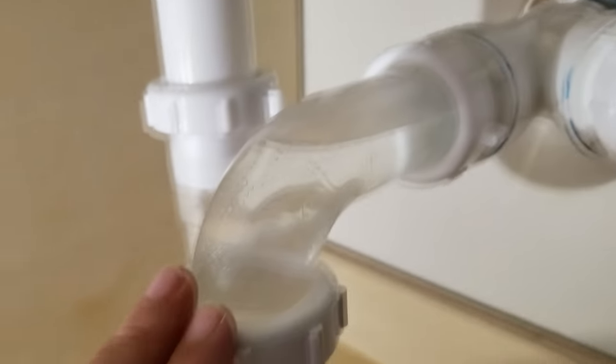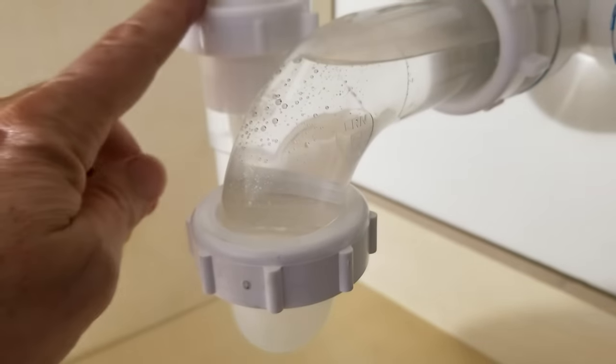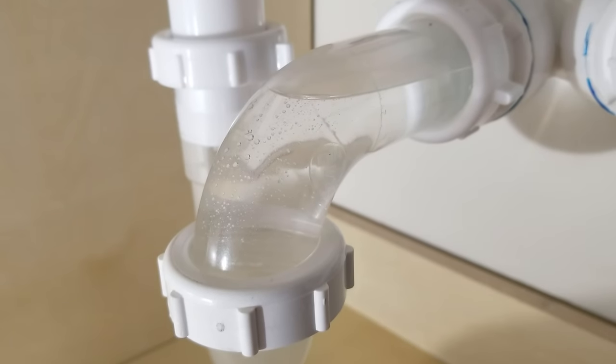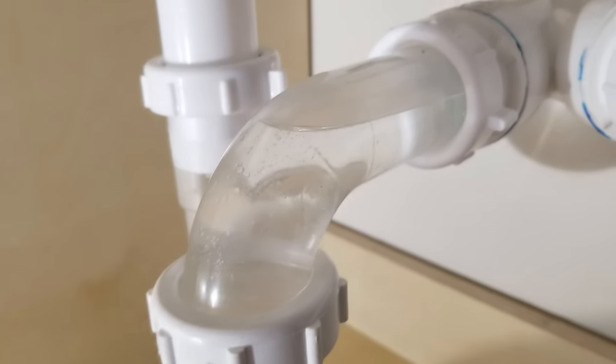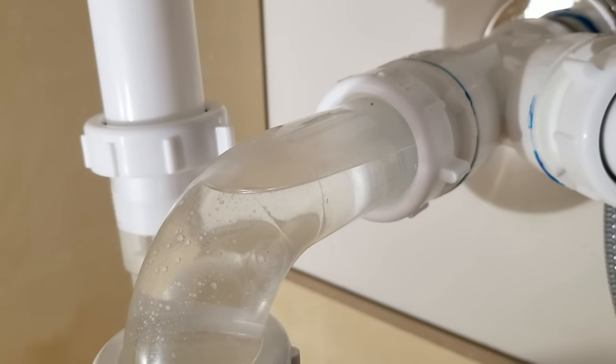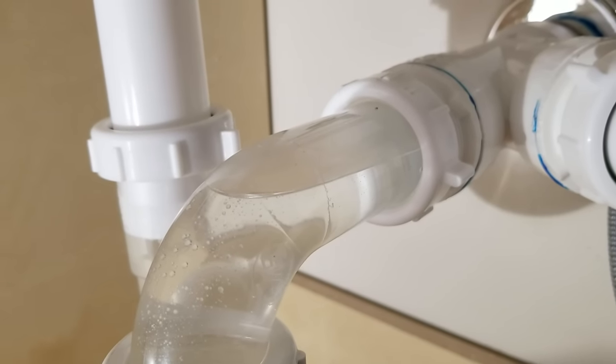And that's what creates what we call a siphon. And it can actually cause the water in your P-trap here to disappear. It'll just suck right out and down the drain there, if there's no air behind the water. Now here we have it, so we're okay. We got a little bit. It's not as perfect as I want it to be, but it does work.